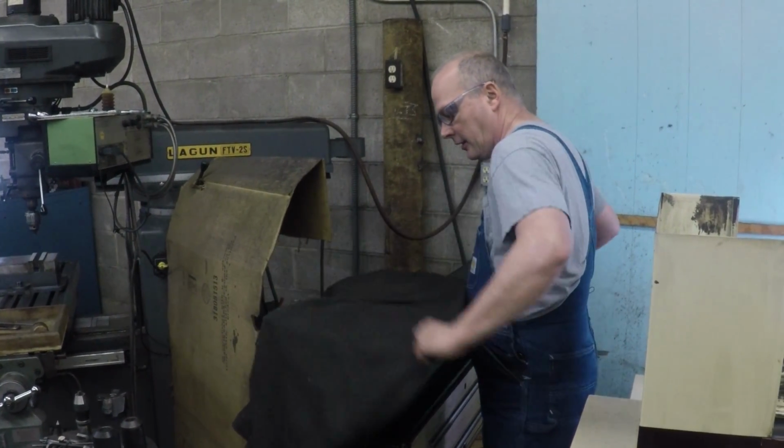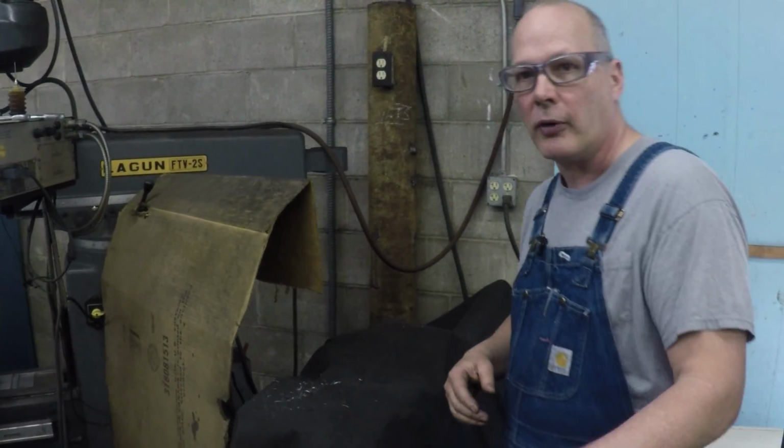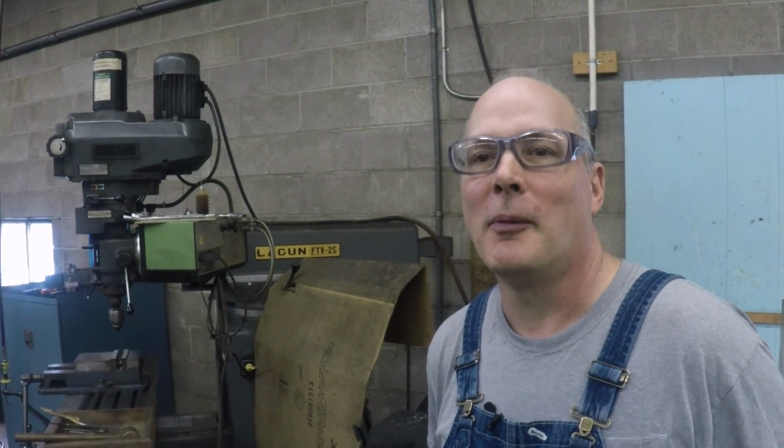Now, you can buy broaches for a vertical machining center. Have you seen that? Yeah, I've heard debates though on how good or bad it is for your spindle bearings. That's the very debate why we don't have one, because I haven't figured out whether it's okay when your spindle's stopped and you're pushing on it like that. One of the companies I talked to is a German company, and they go up to a 5/8 wide keyway. I was wanting to cut a 1 inch, and they said, "Well, we can make you a bar to do that." A 1 inch wide keyway. Good grief. So I was like, I'm not sure I want to do that to the spindle. I don't want to be the guinea pig.